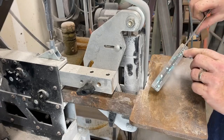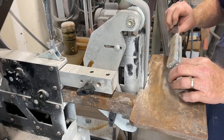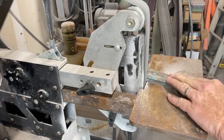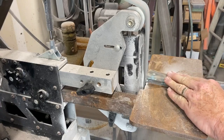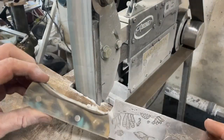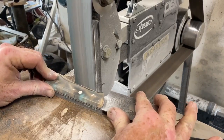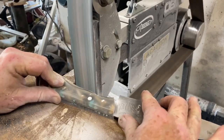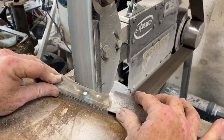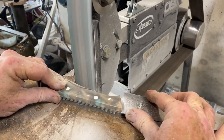I finished profiling my knives right on the 2x72 belt grinder. I usually use a 90-degree table and about a 60 grit belt, and I'll profile it until steel is showing on the full tang. I'll even do the inside curve by letting the belt kind of overhang the right side of the flat platen, and that allows it to take the curvature. The 2x72 is great because of the size of the belts and the power of the machine — it really goes through this stuff pretty quickly.